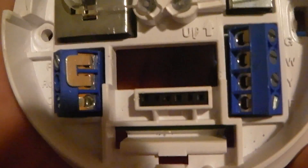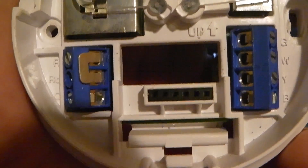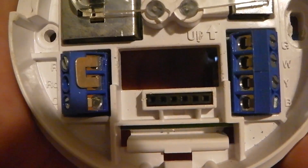However, you want to future-proof things. So if you're ever installing wiring and don't need a fancy thermostat right now, try to install at least five wires in your wall so that people — or you — can upgrade later on.